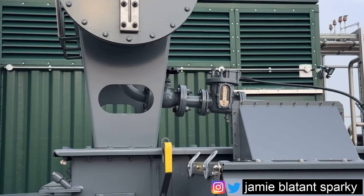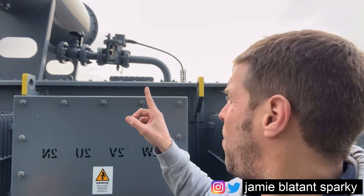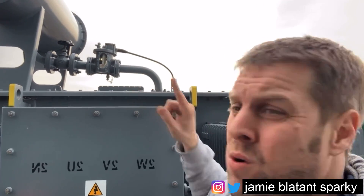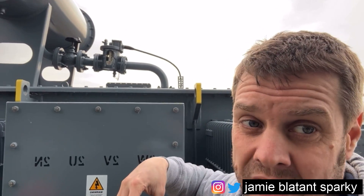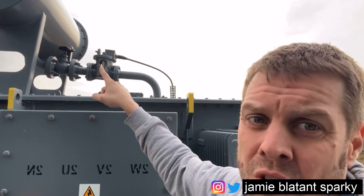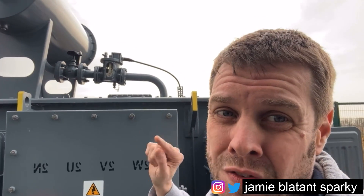On a hot day or under high load the oil level in the conservator might be higher, and on a cold day it might be lower. That's called a conservator, and when you have a conservator you have one of those - a Buchholz relay. That Buchholz relay up there does two jobs. First: if the oil leaks out or gets low, and there's such a small amount of oil that as it drains the conservator drains through the Buchholz, a float inside sees the oil disappear and falls down into the void where the oil was. It cuts the transformer off, because if the oil continues to leak out the transformer will explode - which is obviously quite bad.